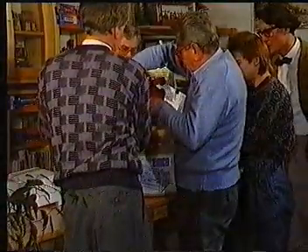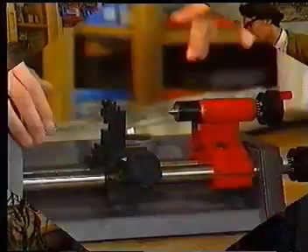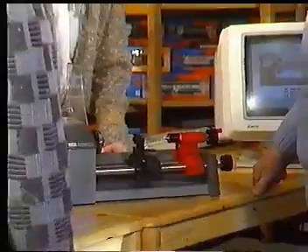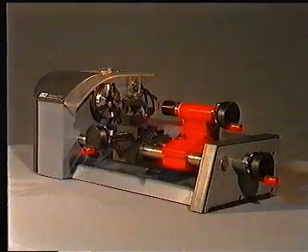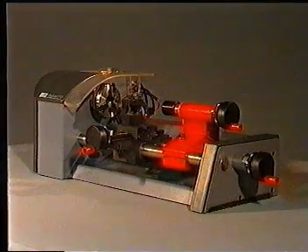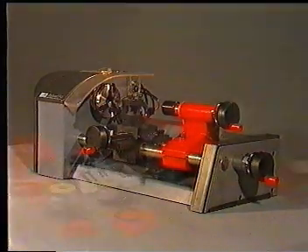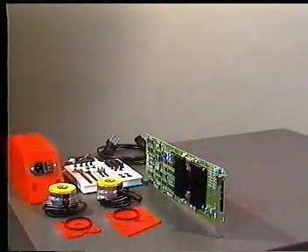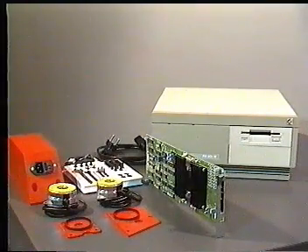What is special about the Unimat? The Unimat PC is a conventional lathe with a sturdy steel machine bed and basic features, which leave absolutely nothing to be desired. But the best about it is that you can retrofit these machines with a PC package, converting them into fully-functional, small, automatic machines. And there's even more — you can actually design on your screen with a CAD program. The PC must be IBM-compatible and have 640 kilobytes, two drives, or a fixed disk and one drive.